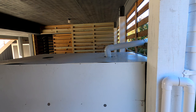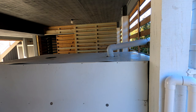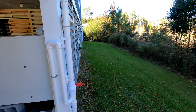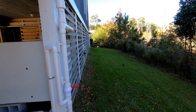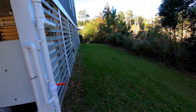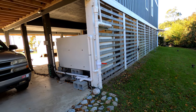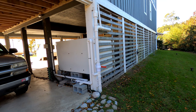So we've got 11 totes total. The way I've scaled the system, it needs about 250 to 275 gallons of water a day for watering. I decided to go with 11 totes, so I basically have 11 days of watering if the totes are full. To fill all 11 totes — four out front and seven in back — I need about an inch and a half of rain if the totes are completely empty.